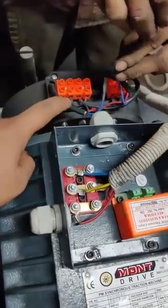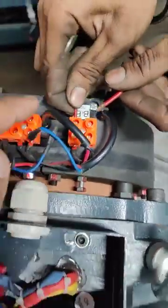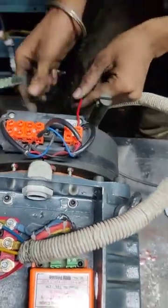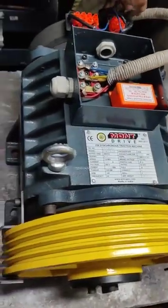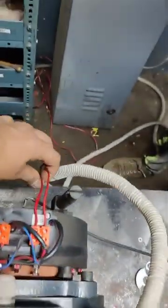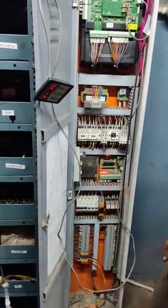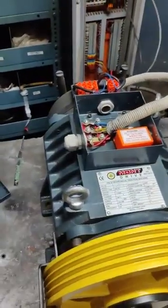This has around six conductors on the brake. The sticker mentioned to connect independently: B1, B2 at 110 voltage. This wire is coming from the panel — we need to connect it there. Now U, V, W1 wire connected, then brake wire connected with the panel, switch on.